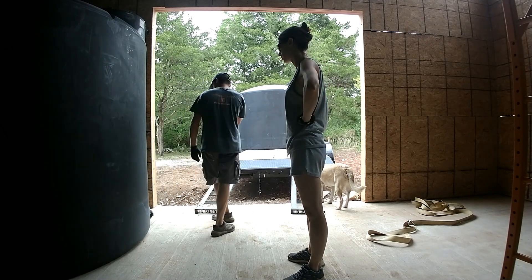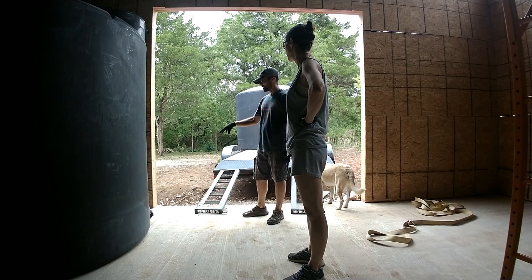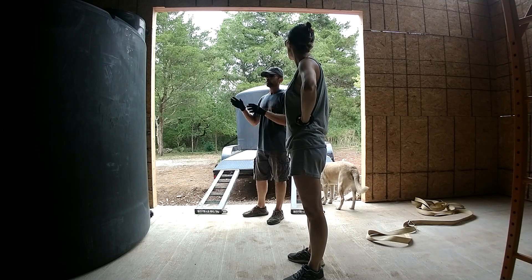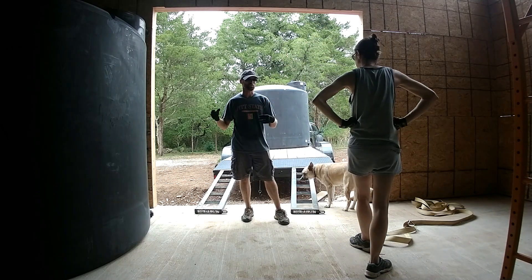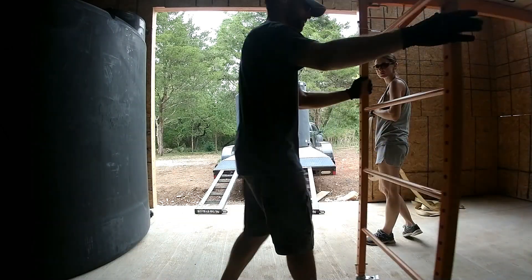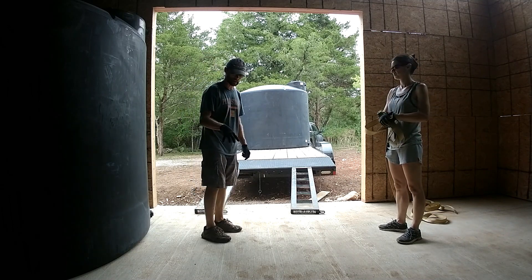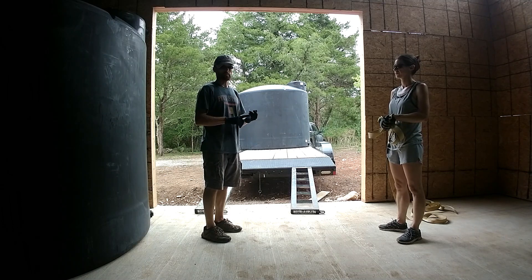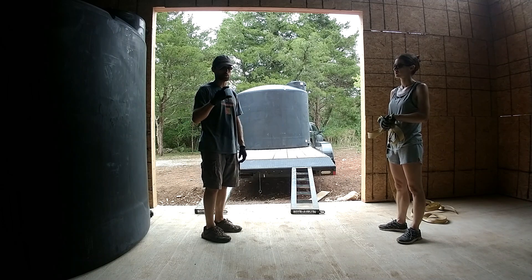Maybe you need to push this one against that wall. No, I think it is against the wall — it wasn't this wall. Because this has a thickened footing. No, that's the inner slab. I want to make sure that if one of these is full and you spring a leak, we need to change it so I can get it out without having to drain both of them. We can rotate it later. There's a thickened slab around the edge of this which is a little over a foot thick, and then this slab is about a good six inches thick with welded wire mesh and rebar going in both directions every two feet. But when it gets up next to the house, it drops down to only about a four-inch slab.